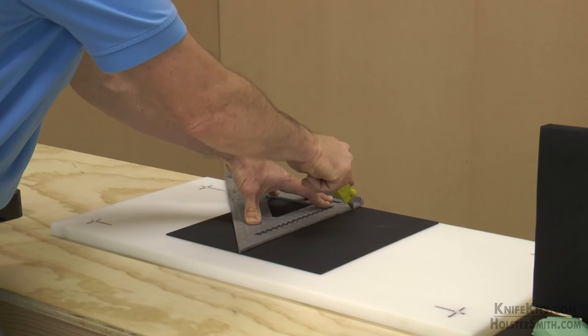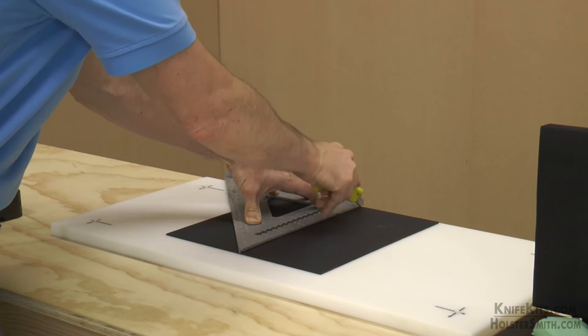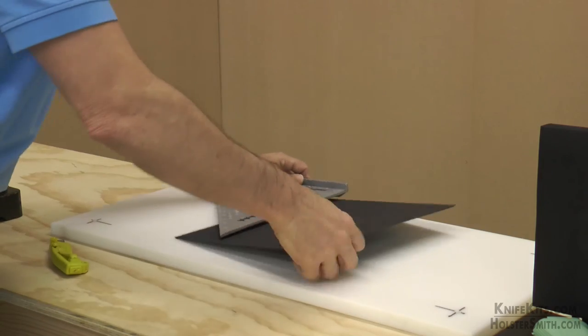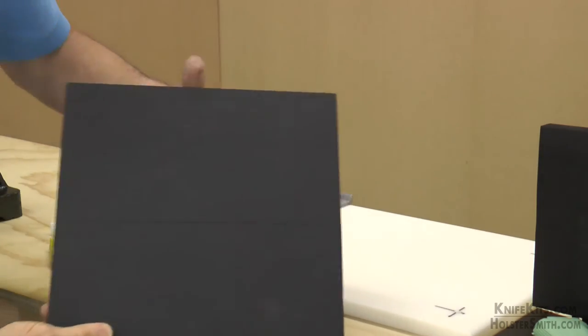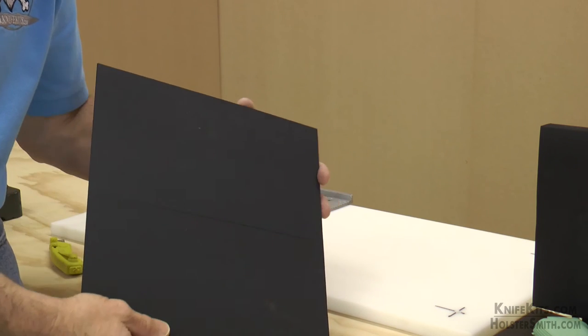Give yourself a second run — notice I'm not running it off the cutting board. A third one will be fine. Get a nice little line in there, and if you do that correctly and you do it enough times, you'll notice that your scoring line is nice and deep, and you didn't have to fight it at all.